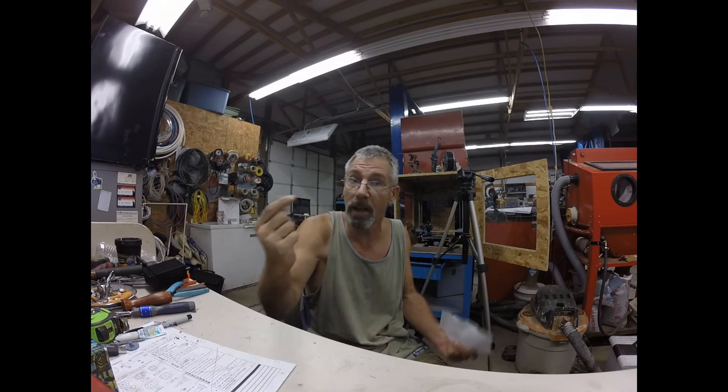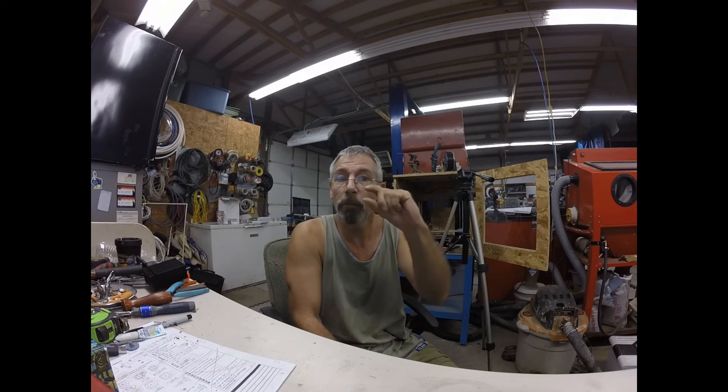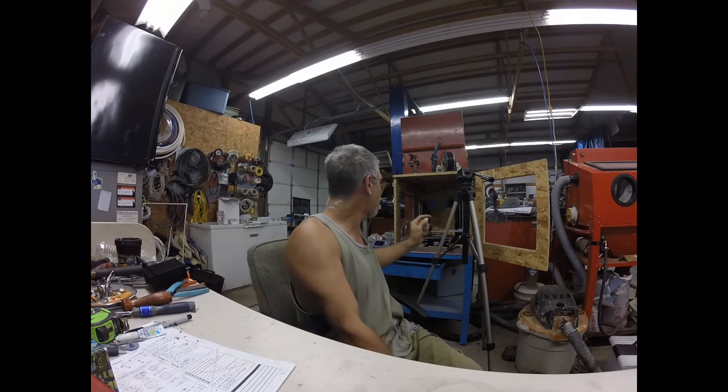It's definitely worth getting that sensor — it's very accurate. The only drawback is the sensing distance is kind of close. You can't use the glass bed because glass is too thick and it won't sense through the glass before the sensor hits it. But if you're using BuildTak or masking tape on the aluminum bed, you'll be fine.